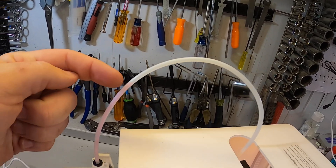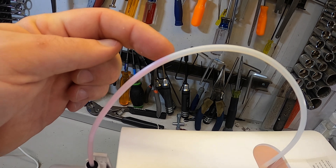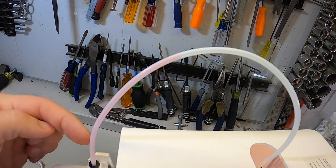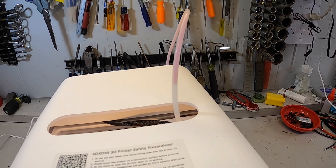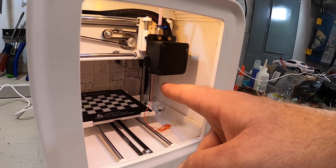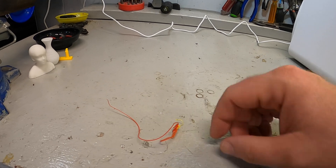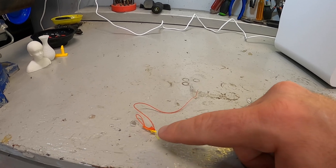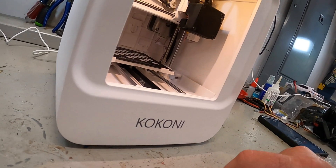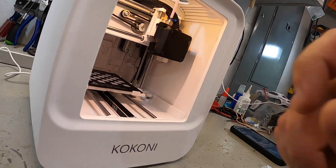Now we click the next button and the filament goes — I hope you can see that red shade coming through there. It's slowly filling the tube all the way through. As it feeds that material in, watch down here because it'll actually squish some filament out — you can pull it out and take a look. You can see I went from yellow to red with this switch, so it pushed out some of that yellow. This is a great opportunity to look at your nozzle and check how clean it is — you want your nozzle to stay really clean otherwise it'll screw up your prints.